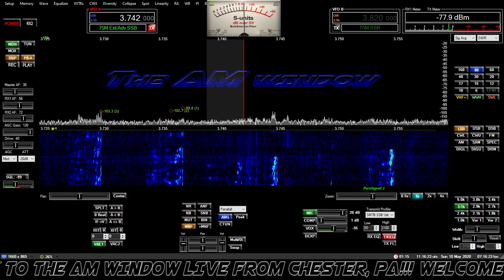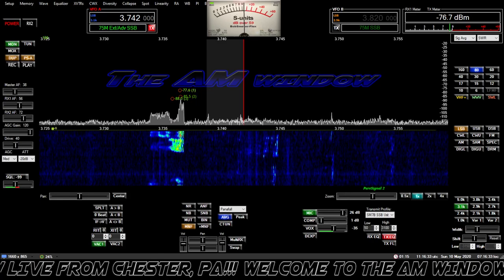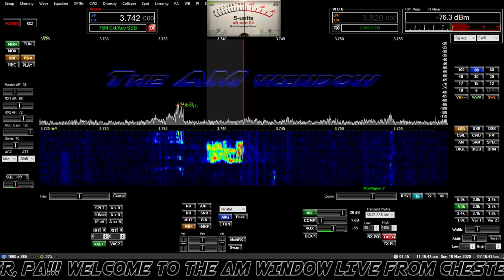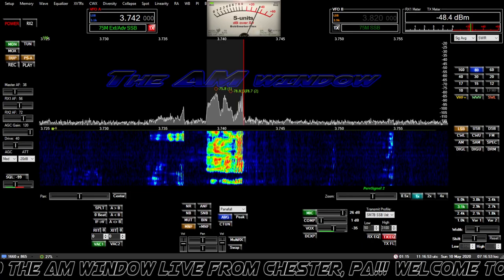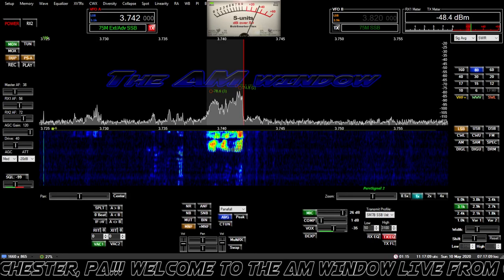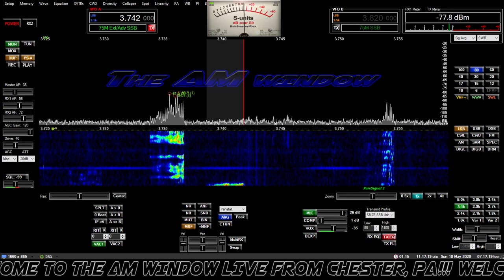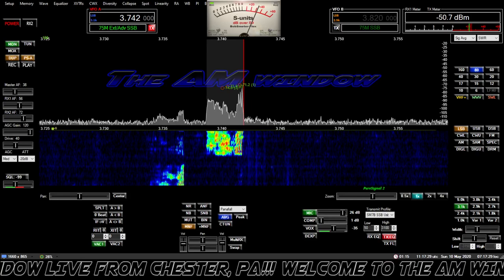You're getting two of them. Oh, I didn't know you had 188s. I'm not sure if that's really an upgrade. I mean, do what you want, but it'd certainly be a lot easier just to put another 188 in there. Then you're not going to have all those bias issues and everything. I don't understand why you have to re-bias it. It's very simple just to replace one of the ones that was in there. I'm sure it'll be okay. It's just a little bit more involved, and you had to spend the extra couple of hundred dollars.